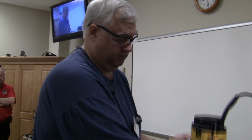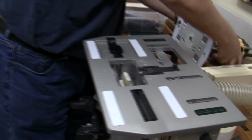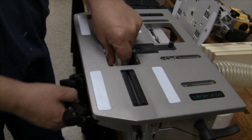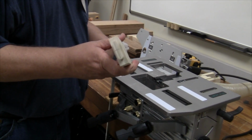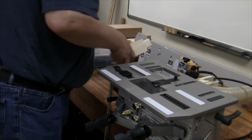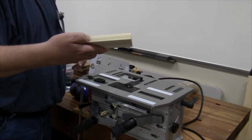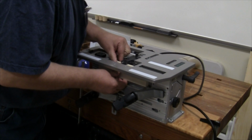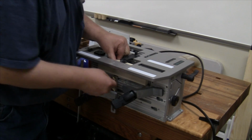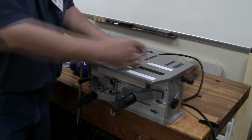Now we'll take a look, make sure that we got all the material removed. Yep. Let's see. Do the mortise. And I just need a single line for the mortise to sight that in. I'm really not going to worry too much about that today. Is that a center line? It's a center line. And I don't have crosshairs because, again, if I were to move the table, it's already locked in front to back, so there's no need for both crosshairs.